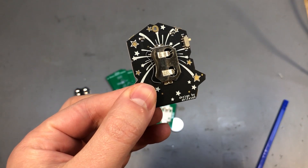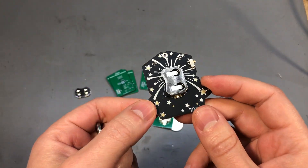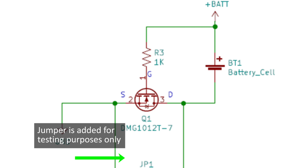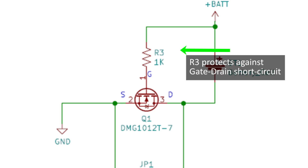Now we start talking about protection at the electrical circuit level, and the method I like to use is a low-side N-channel MOSFET. This is the schematic of the circuit I'm talking about — it's very simple, just a MOSFET and a resistor. You can pretty much mirror this on the high side if you'd like to use a P-channel MOSFET, but typically N-channel MOSFETs have advantages like lower cost, better availability, and lower RDS(on), so most of the time you will prefer to use an N-channel version. You could also argue that the gate limiting resistor is not necessary because the current into the gate is pretty much zero, but if you're thinking about putting a product on the market and getting safety certifications, you need that resistor in there to protect against a short circuit either by a failing MOSFET or through some other defect in the circuit that could short the gate to drain.